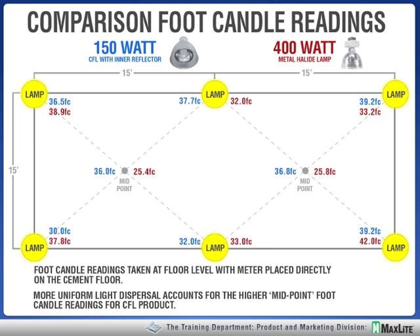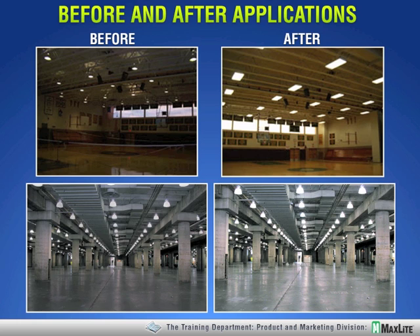The photographs at the bottom show before and after of the facility from the previous slide — a very large conference center in New York City, one of three halls. Eventually we retrofitted two of the three halls with high power CFL. The third hall had 40-foot ceilings and they're sticking with their 1,000-watt metal halides — there's still no good retrofit option for them. T5 didn't cut it, T5 six-lamp didn't cut it; maybe a T5 twelve-lamp would do it, but as far as I know they're sticking with metal halide today.